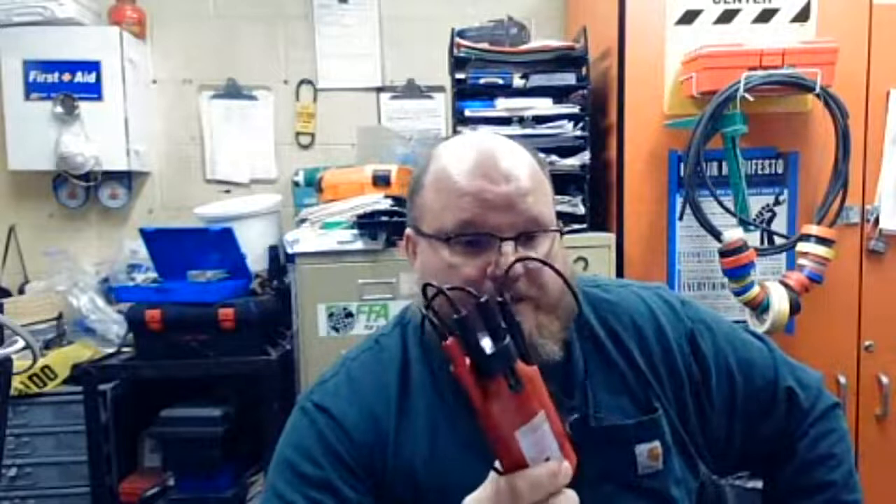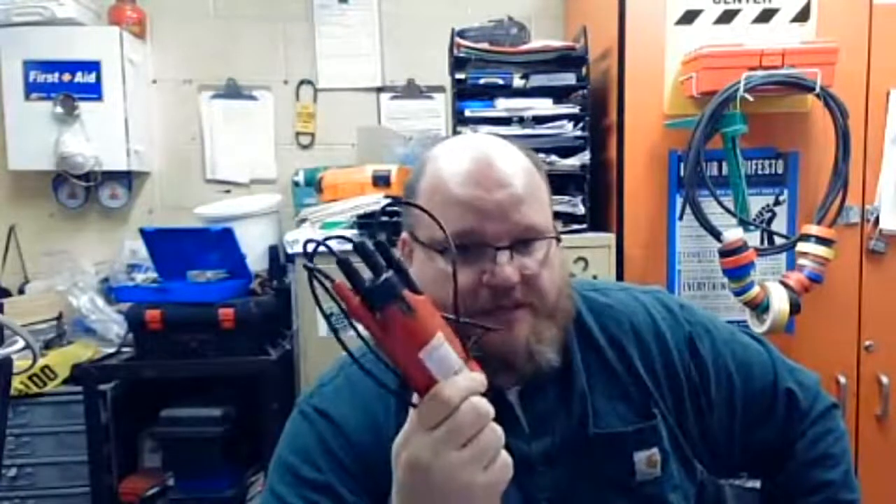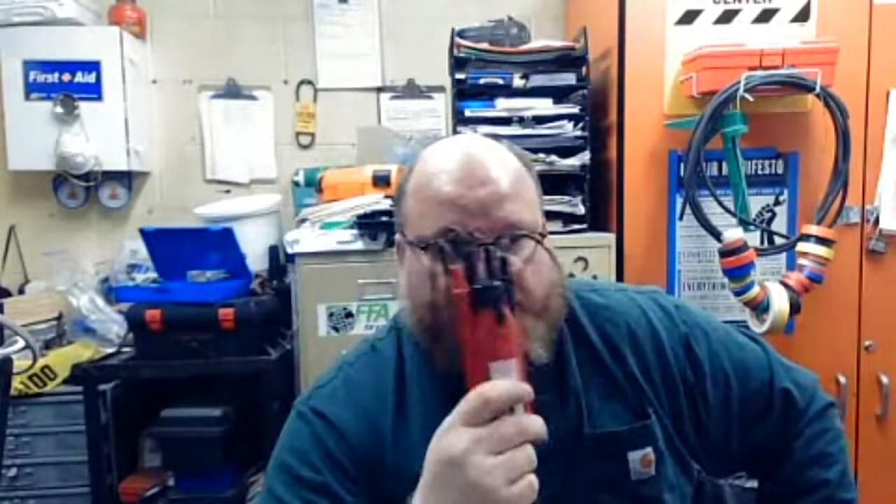I like these and I'll always keep one around. Wiggins is the original brand — that's what most everybody calls them: Wiggies. I always have one of these in my bucket because my battery may be dying on my DMM — this one just works without batteries. Always test it on a known energized circuit before you go try to troubleshoot or do anything else, to make sure your tester is working. That goes with any of the testers — test them on a known operational circuit first.